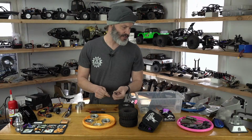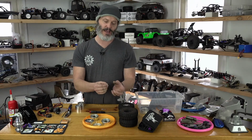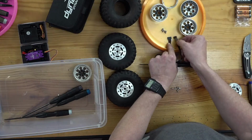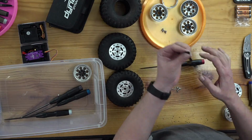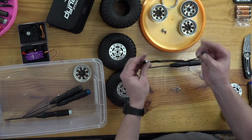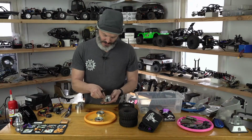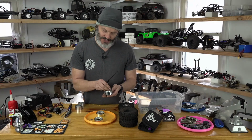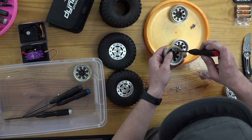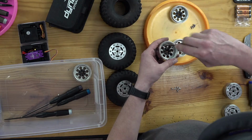Typically on a Copperhead, there's going to be another plug right here, and your standard sensor wire will plug into that. And then there is this different plug. You can maybe see there's a little different size between those two. That goes into the ESC directly. You definitely want one that has the ESC's correct plug on that side and a normal sensor plug on that side. At least long term, it is a good idea. With the adapter piece that comes with many Castles, the risk is that it gets contaminated. You have one extra plug in line with everything. That's generally not advantageous.